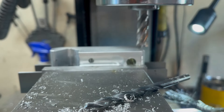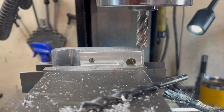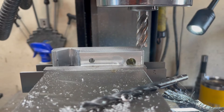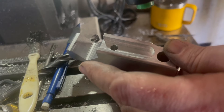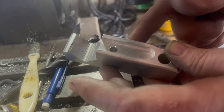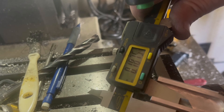I need to create a little step-down because the distance from the black ring to the end of this piece is less than the thickness, so when I put this in it has its full length sticking out. I'm going to go down about 80 thousandths and then an inch deep — I went down 99% of my Z height and then did a finishing pass for that last 1% for a nice finish. Let's check the effectiveness of the edge finder: I ran a half-inch end mill directly through the center of this seven-eighths wide piece, so what's left should be three-eighths. I measured 0.1875 on one side and a half-thousandth under on the other — it works pretty well.